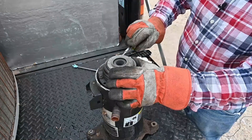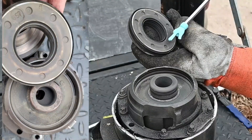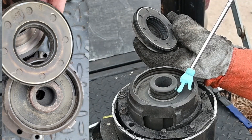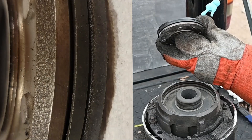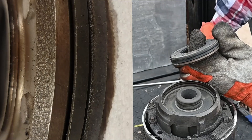I'm going to pop this floating seal out so we can take a look and see if there was any damage on it. Here we can see more signs of overheat — see how that's been burnt, it's all black in there. This compressor is definitely running hot. There are signs of overheat all in the bottom, but the actual sides of the floating seal itself look really good. I don't see any damage with the actual sealing side, so it's in really good shape as far as that's concerned.